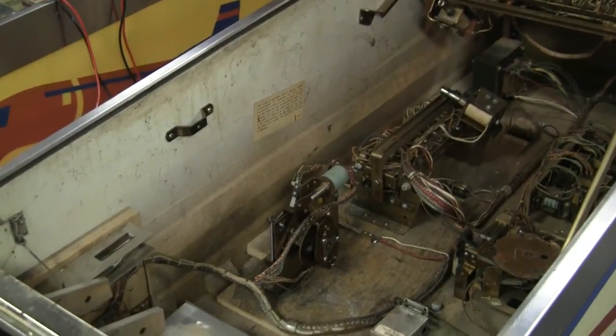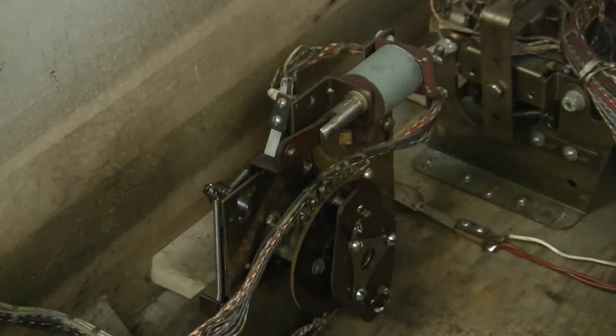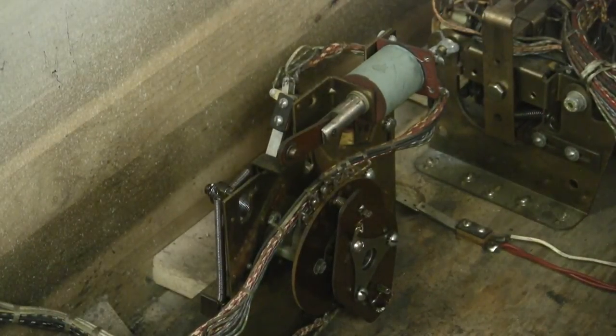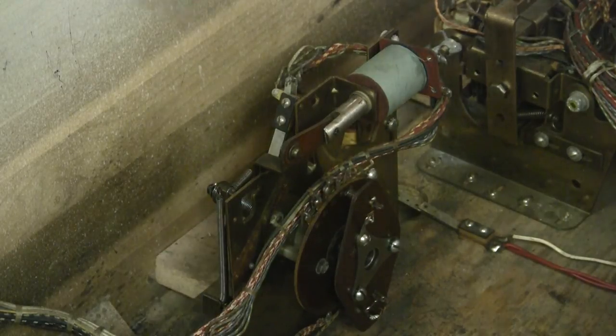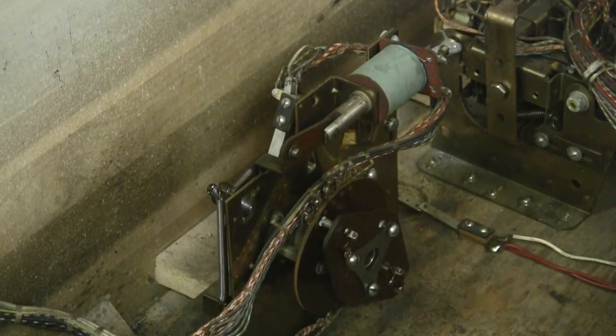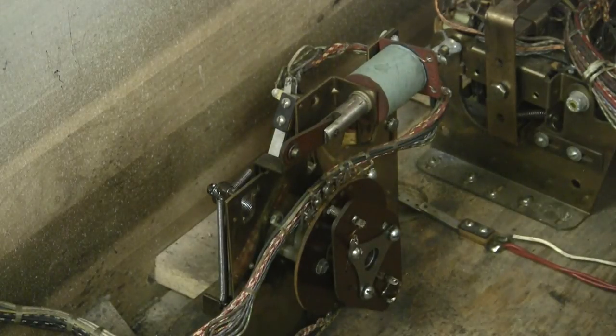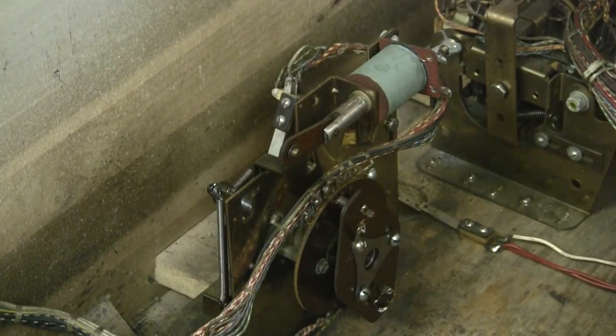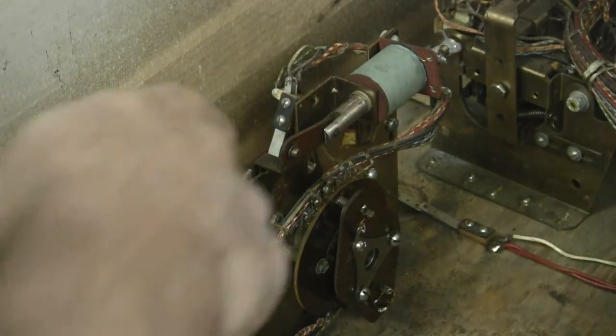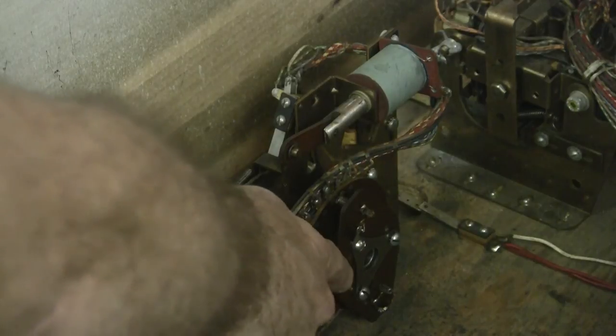Let's look down here and I will touch this relay like the ball is being kicked into the shooter lane. You can see it's reached the end — reset it. So it's advancing: when the ball is sensed, it kicks the ball, and as the ball goes into the shooter lane it passes across that switch — bam, advances the ball counter. The problem is the ball counter thing is misaligned, so the contacts are wrong.